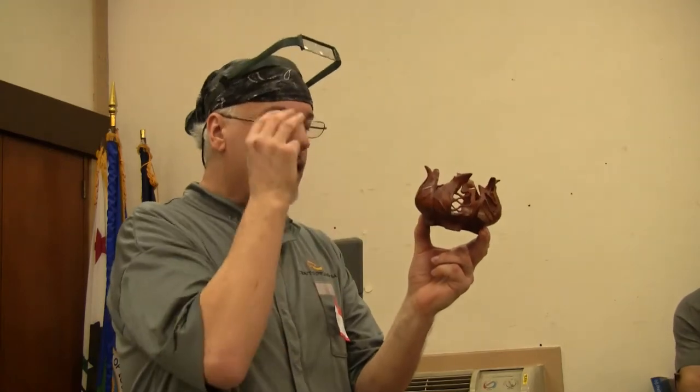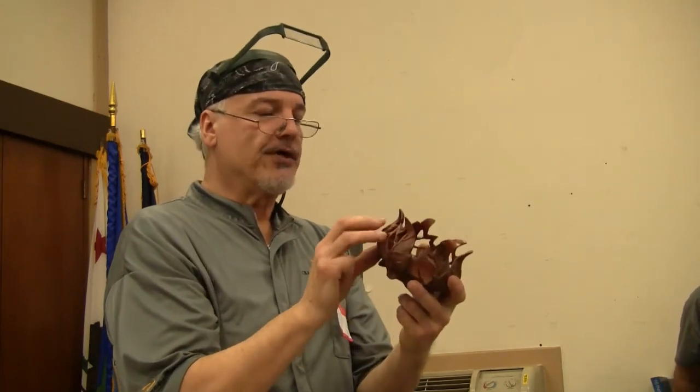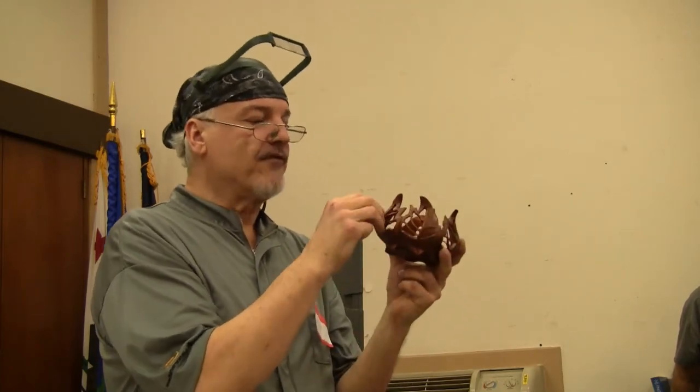Again, different types of burrs. This was a leaf bowl. I wanted to give the leaves a little bit more flow, more of what it would really look like on the tree. So basically, you turn the bowl to give this basic shape, you draw on your leaf pattern or whatever you want to do, and then you just start carving it out, showing the veins of the leaves. I pierced holes in it, as if the veins were left there and the leaf part was gone.